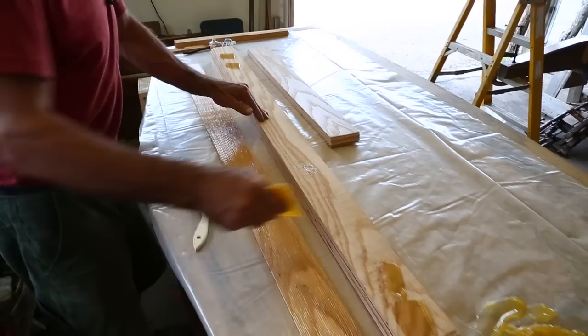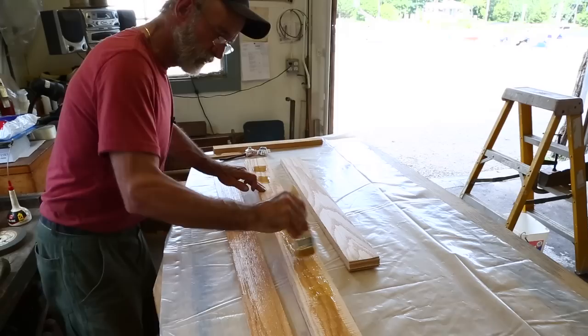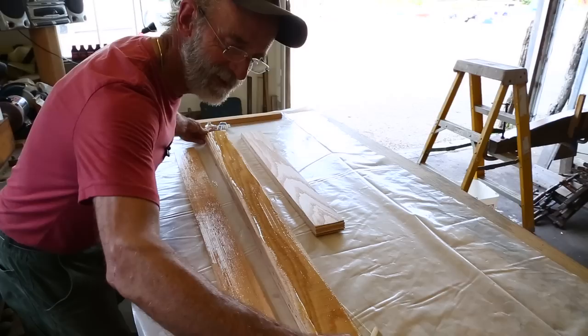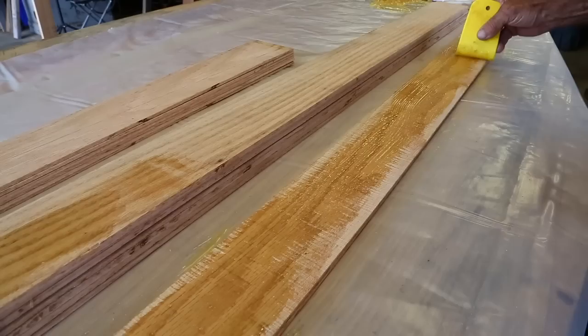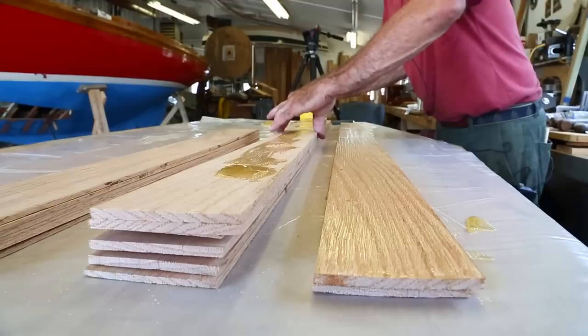Now that I've scraped down most of that, I can go back to my supply and put a little bit more on this laminate. I've actually got the bristles folded right down flat and I'm almost spreading it with the metal part of the brush. I'm using a brush that's narrower than the laminates so I can spread a volume of glue right down the middle without getting it on the edges. Once I pick up the tooth trowel, I can use that volume to spread towards the edges. I've ended up using the tooth trowel to pick the glue right up out of the pile and spread it onto the laminates — that's working just as well, so I'm going to do the rest of the laminates that way.